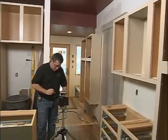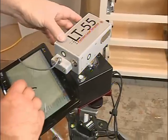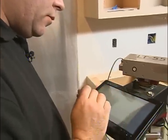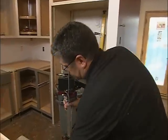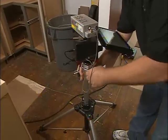It starts with a template for each top, and Corey Clevin has a laser system that can lay out even the most complicated pieces quickly and accurately. That's crucial because you want to have all the cutting and finishing done to the exact measurements at the fabrication shop so that the countertops slide in without a whole lot of scribing and tweaking to make them fit. It used to be a job in itself, cutting and gluing plywood strips to form each template, so this really streamlines the process. I don't know how we could even survive doing that anymore.